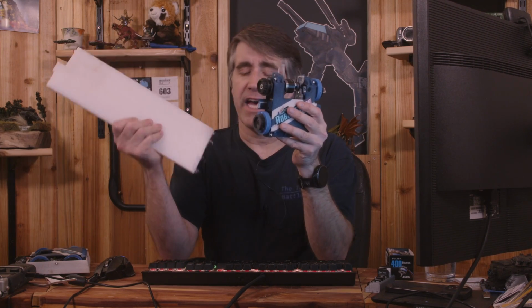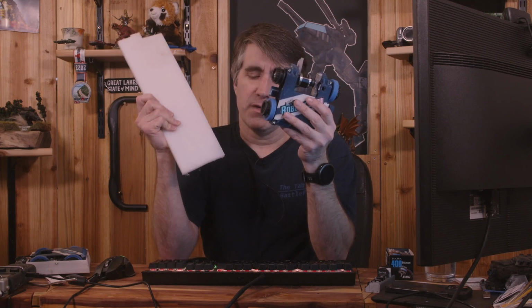But of course, the big thing is going to be the weapon cage itself. I've demonstrated here that this weapon cage is not sufficient whatsoever. Now, the exact details of what I'm doing, I'm not 100% sure about, but the big change is going to be a material switch. I'm going to go from polycarbonate over to UHMW, and the main reason for this switch is how the materials fail.